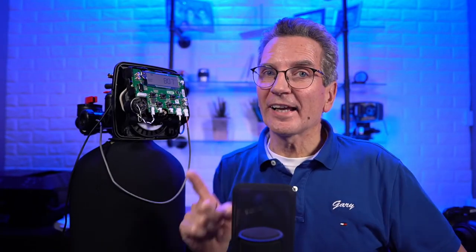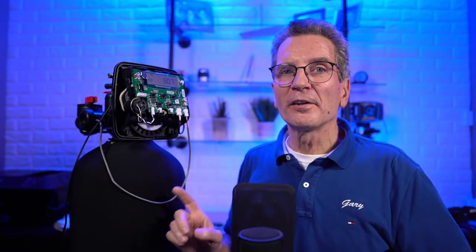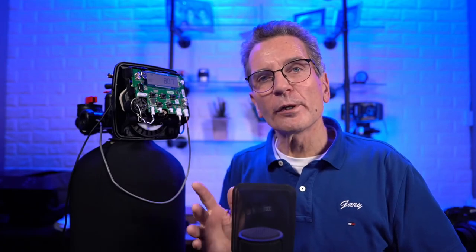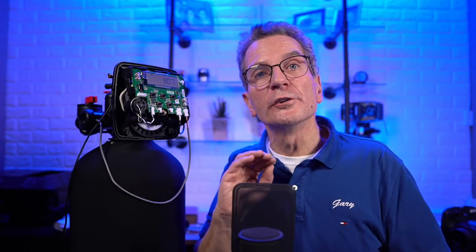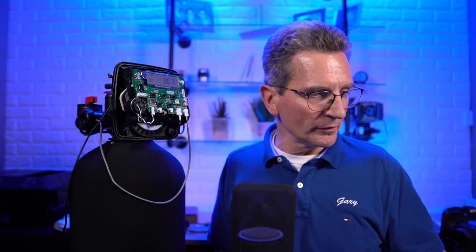Okay, now you can't convert a filter that's used for backwashing sediment out of your water or whatever and make that into a water softener just by doing those parts. There's more parts involved in that, but what I'm talking about here is a time clock three button Clack valve that's used just for softening. With three parts, you can switch it over to the premium CC valve, and you'll save a lot of money on salt, a lot less wasted water, and your family will definitely be happier.